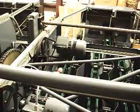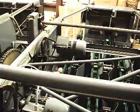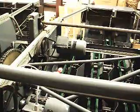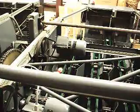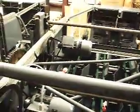One thing you'll notice working on these machines — your ears will tell you more than anything else. A lot of times you're going to hear something going wrong with this system before you actually visually see it. But sometimes you can find big things with your eyes as well, as long as you keep your eyes open. I'm going to run diagnostics to see how that goes. Much smoother on that belt. The big pulley wheel and the small motor pulley wheel are lined up perfectly with each other with that belt. And that's all I was going to show you today — how to get that set back up and make sure it's running properly.